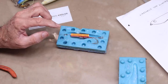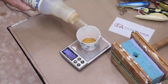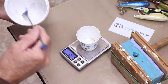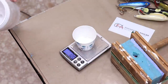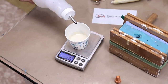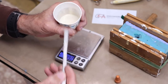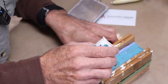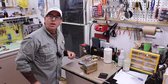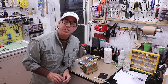Now it's just a matter of mixing and pouring the two-part resin into the mold. Six grams of part A, 1.2 grams of micro balloons — blend that together — then add six grams of part B and blend that in. Pour it right into the sprue nice and slowly in a really thin stream. Now it's just a matter of waiting for this thing to set up, and then we'll go ahead and get a paint job on it and get it in the water in the next couple of days.